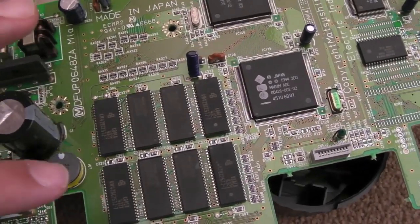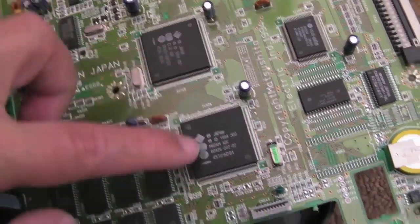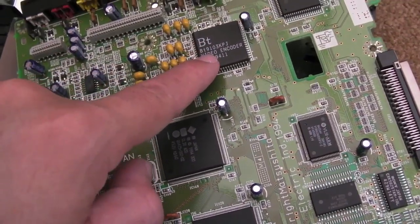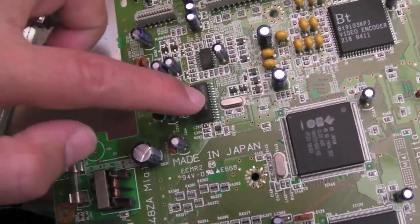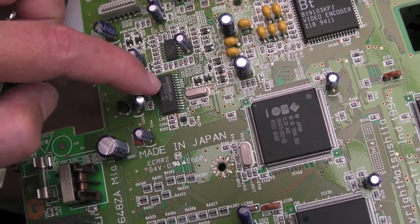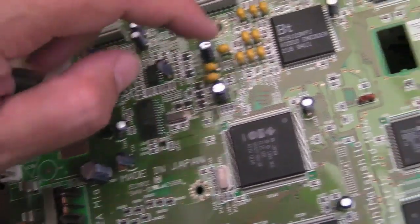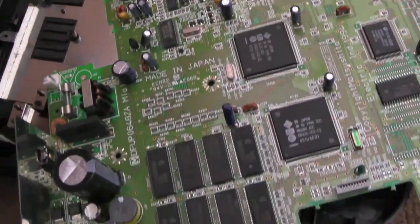So there you go — it's an all-in-one board: power supply at this end, main logic in the middle. These are the two custom chips: Clio and Madam, and there's a VLSI chip — I think that's a SLAM processor — and a video encoder. Regards audio, I suspect we're looking around this area. This could be some sort of DAC to generate your composite. There's a little JRC chip here — could be an audio op-amp, not sure. Up here goes to the expansion port presumably.